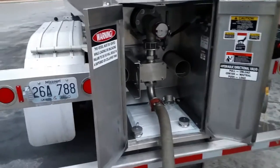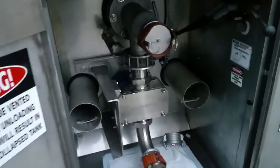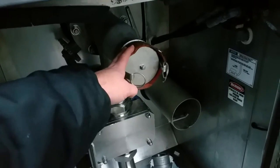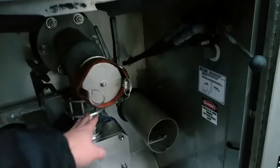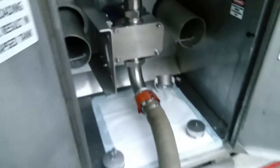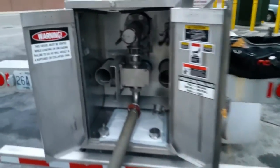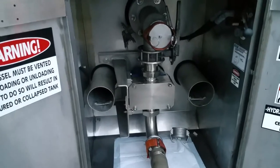We're delivering to a bakery here in Cicero, Illinois. This is the cabinet on the back of the trailer — it's where everything happens when you're delivering a product. There are two ports: this one is if the place we're delivering has their own pump, they'll hook up here. There are two butterfly valves, in this case both are open. The T-valve junction allows product to go through the pump and down into the lower port, through a three-inch hose and into the building and into their tank. It's pretty simple, all run by hydraulics.